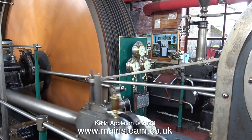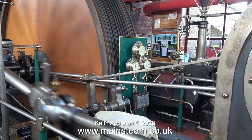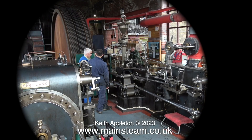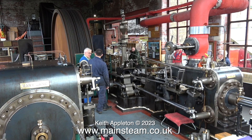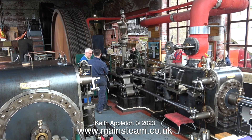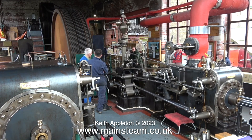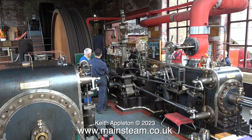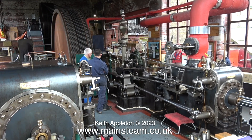His reply? Go away and stop bothering me — that's not actually what he said. This was his reply: any horizontal engine should run over, with the flywheel running away from cylinders on its top side. Loading is downward on crossheads in both strokes. If the upper crosshead guides fail, the crossheads and main rods don't shoot up through the ceiling. Here is Alexander Cairns nearest the camera when we visited Bancroft Mill. The flywheel is rotating away from the engine — and it's just as well, because if the flywheel was rotating in the other direction and suddenly came loose, it would squash everything in its path, including the engine man and my good friend Alexander Cairns.